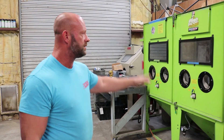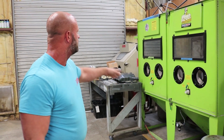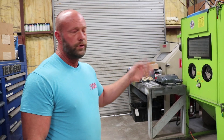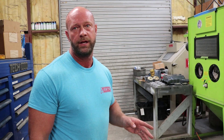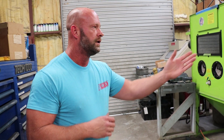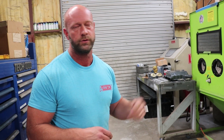We incorporate three different styles of cleaning cabinets. We've got one that's a glass bead machine. We've got the big green machine — it uses a custom-made aluminum shot media. We've also got a vapor blaster, which uses a water glass bead slurry mix. The aluminum media has zero ability to etch the metal. It absolutely removes no metal, but it does take all the carbon deposits and paint deposits off, and it does not checker the metal — it keeps everything nice and smooth. Glass is what we use on cylinders, since there aren't really any critical items inside once they're broken down.